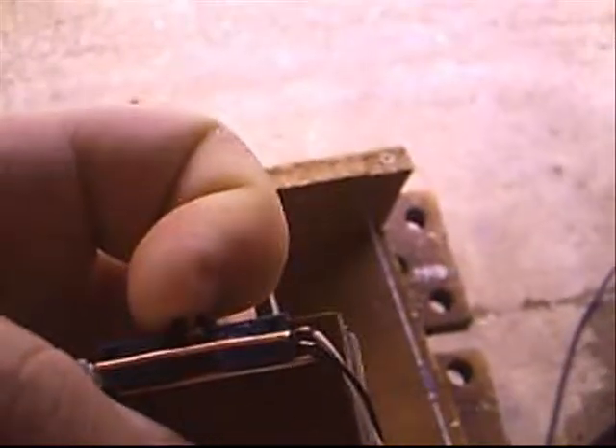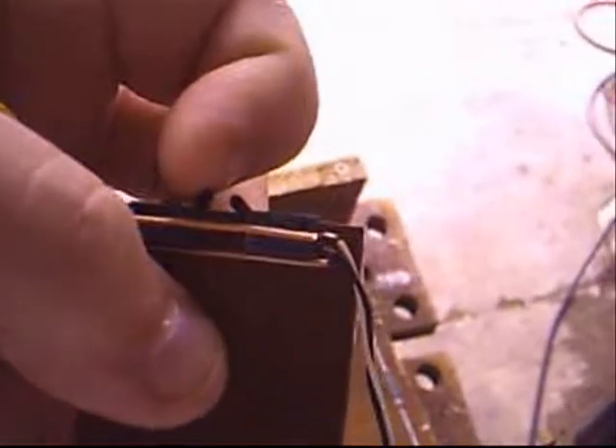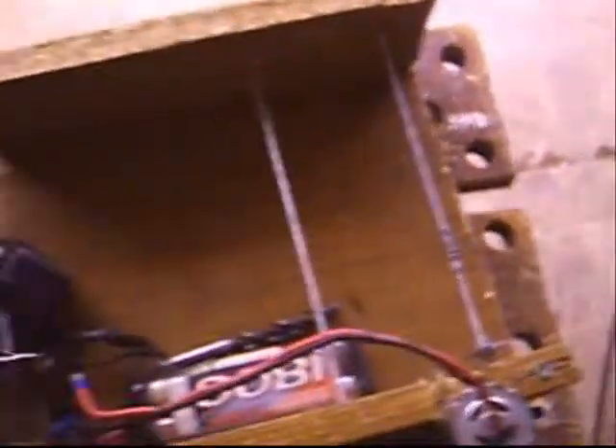I've started building the carriage here. Two micro switches either side, so that when the wire moves down the coil, the carriage will move as well — these two little switches. When it goes to one side it'll wind it up this thread, and when it goes to the other side it'll wind it back down again. Simple enough, no problem.